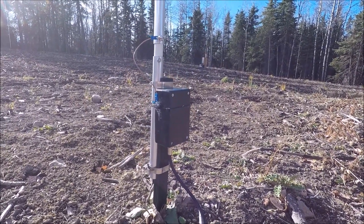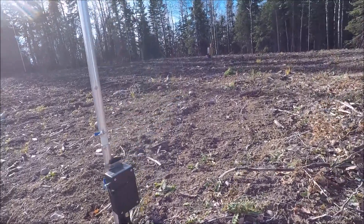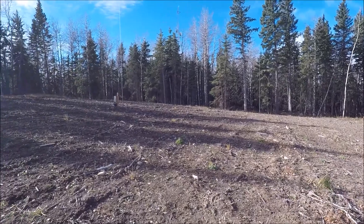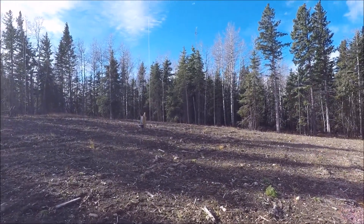Perhaps after this video I'll show a detail of what the amplifiers look like themselves. All of the coax lines — RG6 direct burial — have been trenched and buried and head toward the central box where the switch controller is.